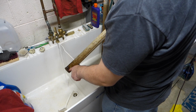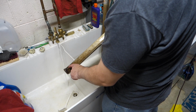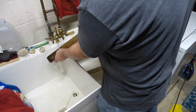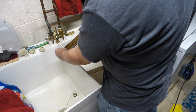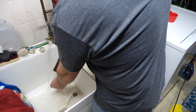And then I'll take my welder and I'll put a couple beads around this area right here to weld the nut on. And then I take my bolt off and then I weld all the way around. The same size bolt as the leg threads. That's what I use. That way when you put your adjuster on, it will screw right on like there's nothing wrong.